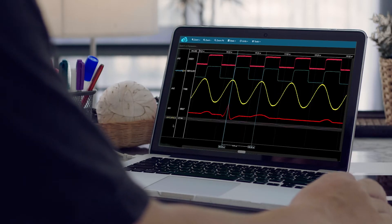The act-on-event feature built into the 2 Series MSO can be used to set up the oscilloscope to respond to events such as trigger, measurement limit failures, search, or mask measurement failures. You can also perform various actions like save data, stop acquisition, or trigger on other external instruments. Mask testing offers a quick and easy way to check the quality of a signal in production facilities or in testing the quality of a signal to a standard. The 2 Series MSO has both limit mask and eye mask capability to perform these tasks. The analysis tools offered on the 2 Series MSO make it easy for you to quickly analyze and debug any problems in your electronic designs.